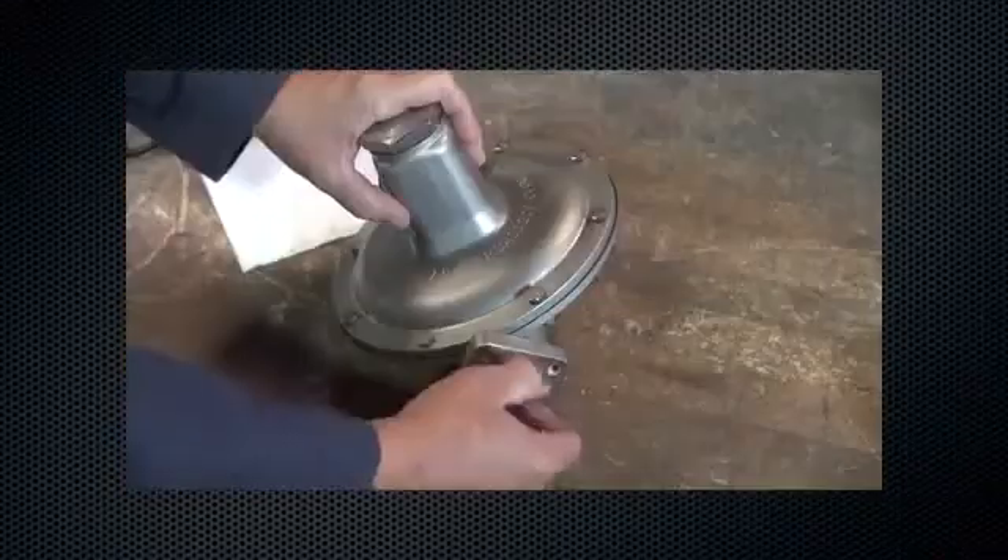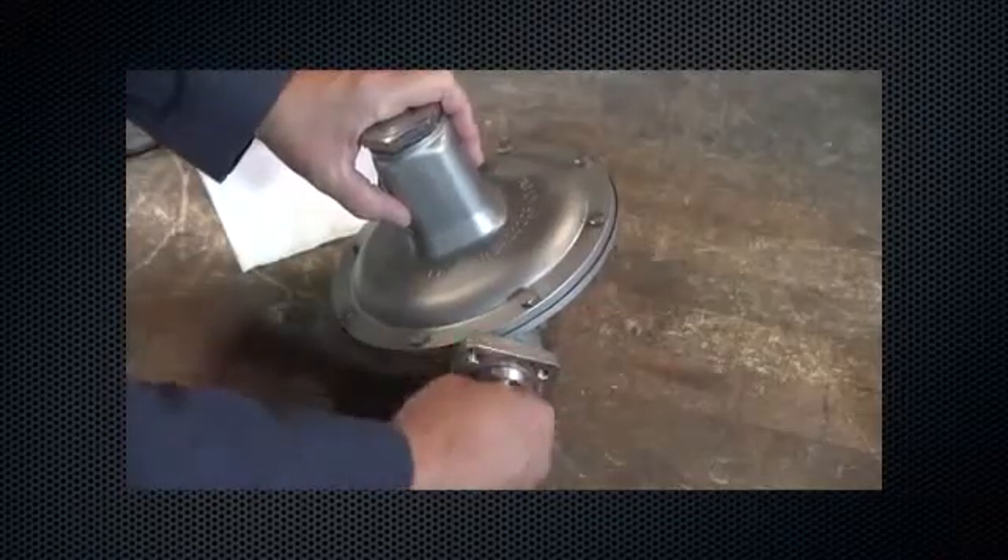For Fisher Type T-205 and T-205B, remove the cotter pin. Inspect the disc assembly and replace if necessary.